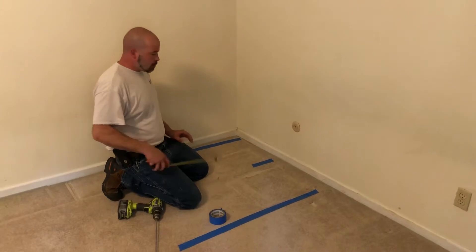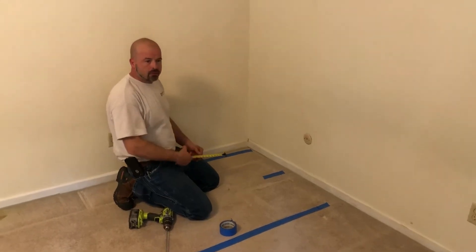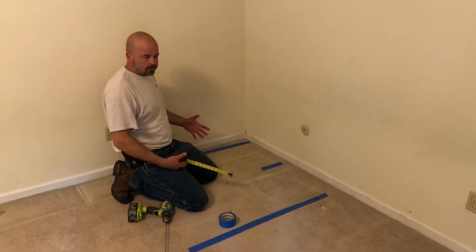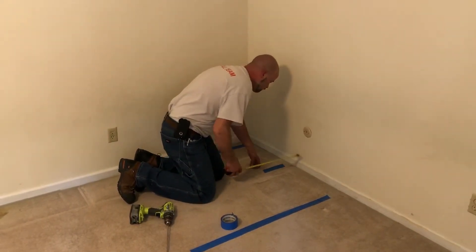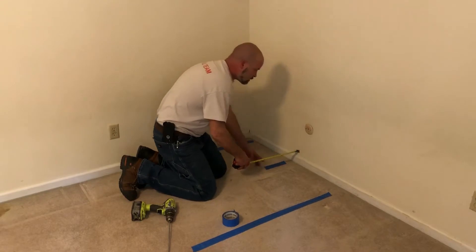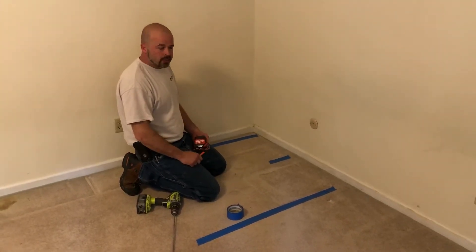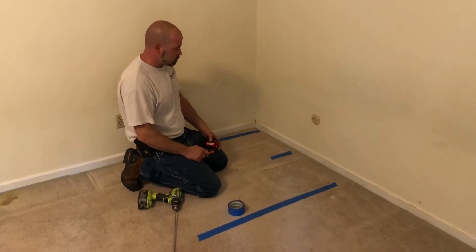I'm marking out the footprint of the back side of the unit to find my center, then drill down and make those measurements. I'm holding my tape five inches off the wall — it makes it easier for the customer to clean and easier to assemble. I've found my center point of where the elevator is going to land. The reason I'm coming off five inches is I have crown molding down there and I want to be as close as I can. Once I open the drywall downstairs I'll determine the center 100 percent, but this gets us 99 percent there.